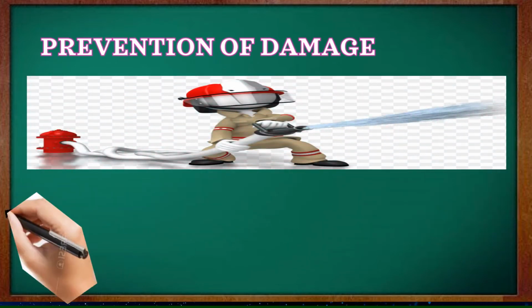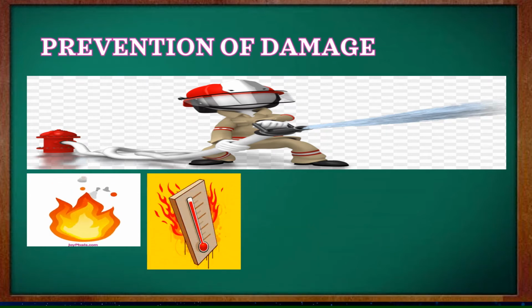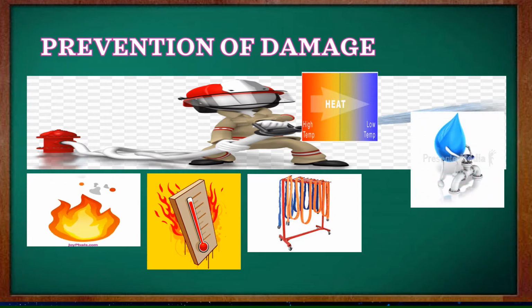First, you need to protect your hose from excessive heat or fire when possible. Second, do not allow the hose to remain in any heated area after it is dry. Use moderate temperature for drying. A current of warm air is much better than hot air. Keep the outside woven jacket of the hose dry. And hose that has not been used for some time should have water run through it to prolong its life. It is not a good practice to dry the fire hose on a hot pavement.